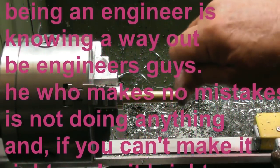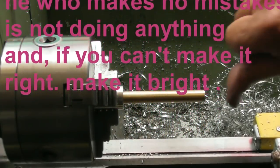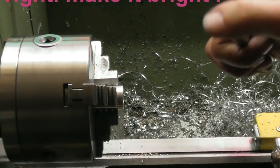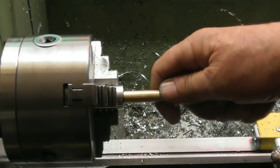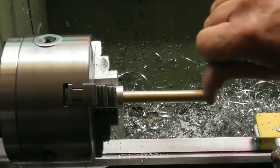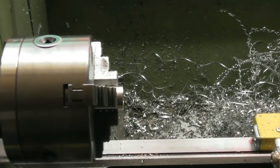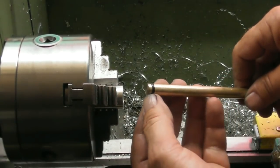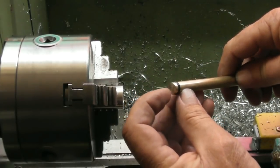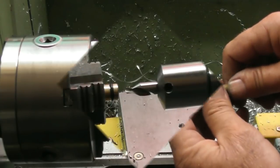And if I push it in, it actually comes back out again with the pressure, with the compression. So far so good. Yeah, happy with that. So that's the O-ring fit and the end chamfered and faced. Now I need to put a pocket in the end to put my combustion material in. So we'll do that next.